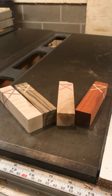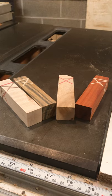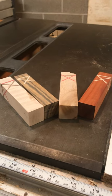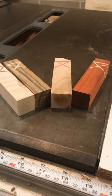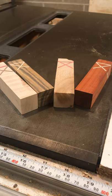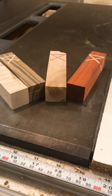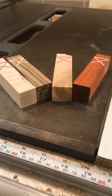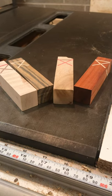The first thing to note is when you start with your pen blank, you need a little bit bigger blank than usual. A lot of people start with a 5/8 by 5/8 or 3/4 by 3/4 inch pen blank, but because there's a little more waste as you glue this thing up, we like to start with about 1 inch by 1 inch. You could probably get by with less, but I would start there.